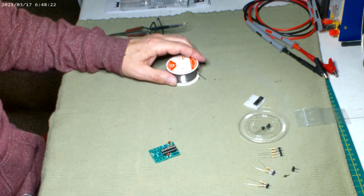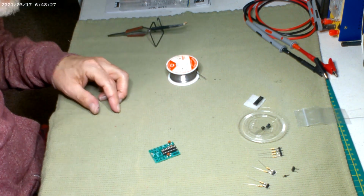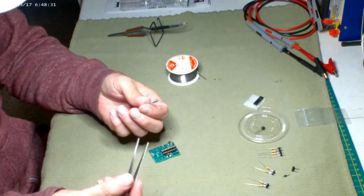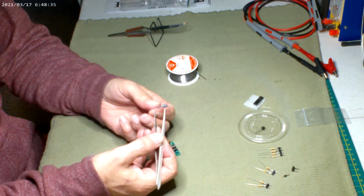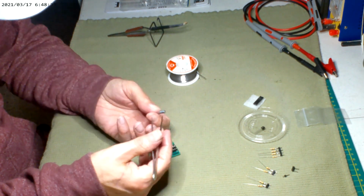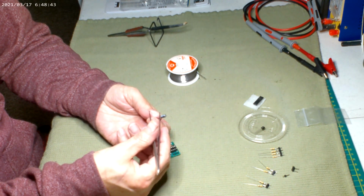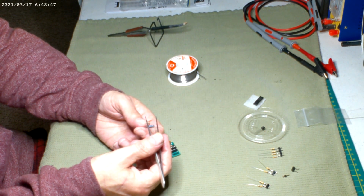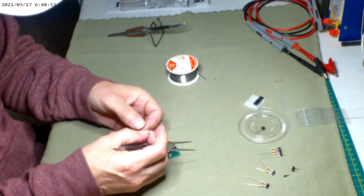Now, should we go with the other capacitor? This capacitor is polarity sensitive. These black ones that are in a barrel usually have a white stripe on one side next to a leg, and one leg's longer than the other. But it'll actually be marked. That long stripe is the actual negative. Yeah, it says here on here, your long pin is the positive, which is another way.